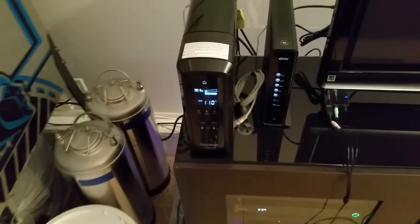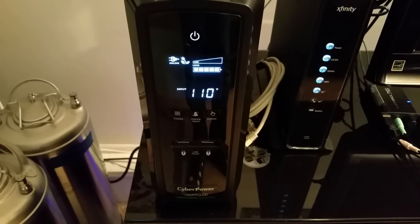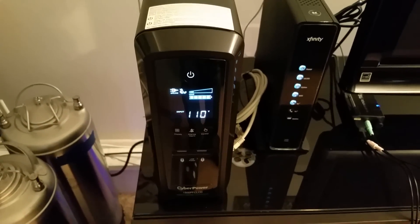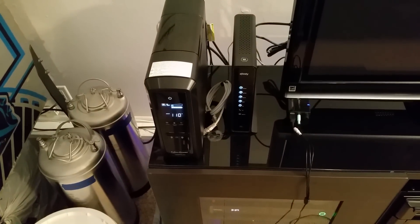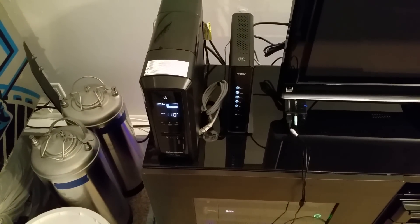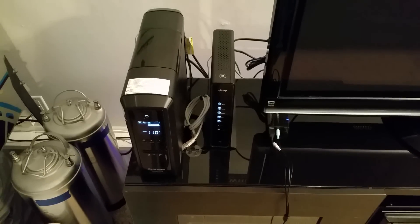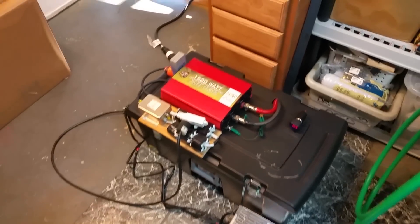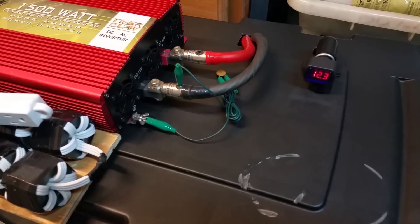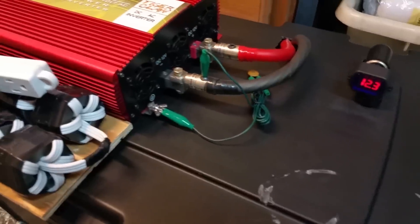There is a little bit of cabling loss even though I'm using 10-gauge wire for most of the run back to the transfer switch — I'm getting about 110 volts out on the branch circuits downstairs in the game room. That's not terrible as long as I can run what I need, whether it be the furnace, lights, or the entertainment center. The fans just kicked on and we're still at 12.3 volts — that's a very stable voltage, and the fans are running the way they should.